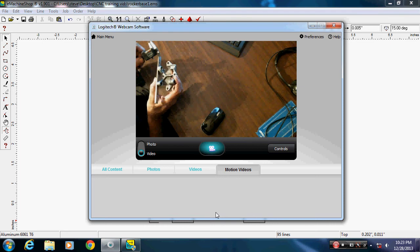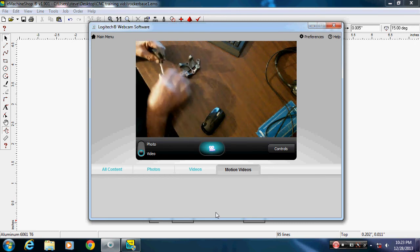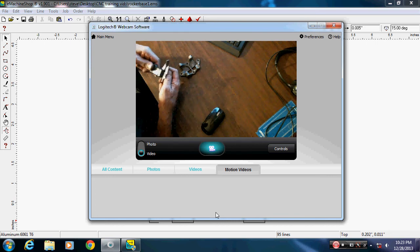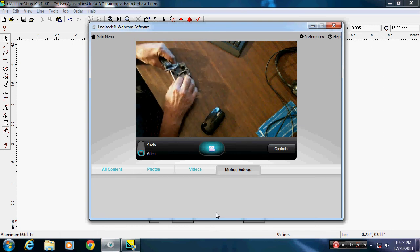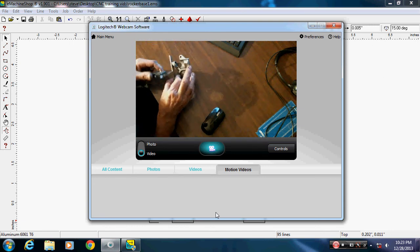So if you want to use something as a bar or something like that, put your caliper on there first and zero your caliper on the actual parallel, then whatever its thickness is will no longer count.